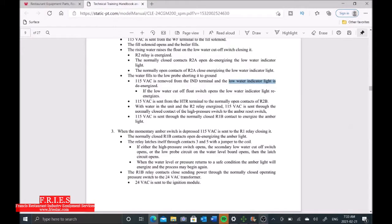The last hint we had was the amber light being on. That comes on when either the low probe is shorted to ground through the water circuit, or the secondary low water cutoff float switch has closed its contacts. So that's telling me either the low water probe or the secondary low water cutoff — one of the two is working — because that amber light is coming on. Let's investigate further which one of these two switches has failed.